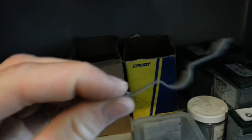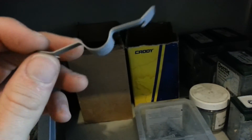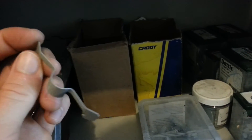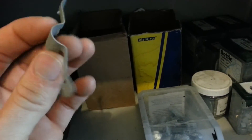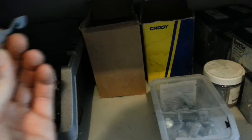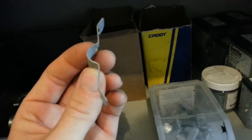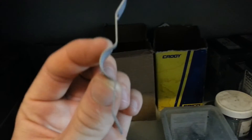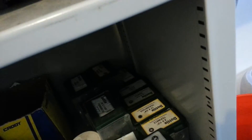These are bat wing MC straps, for if you have MC running up in your ceiling and you have your grid wire — like ceiling grid wire. The electrician will need to run his grid wire independent from the wire that's supporting the ceiling tile. Anyhow, this bat wing attaches to that for your MC wire.